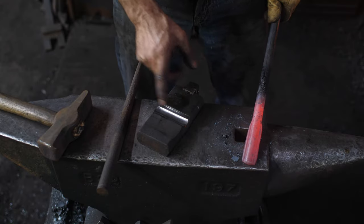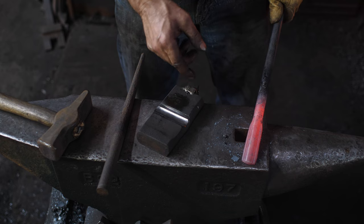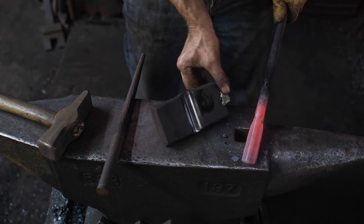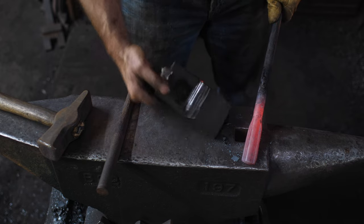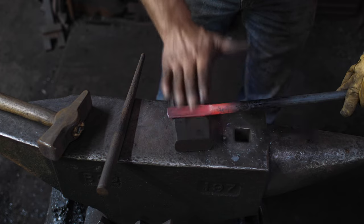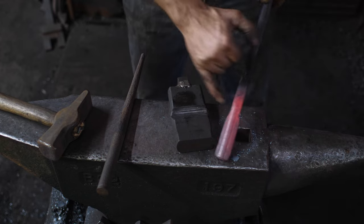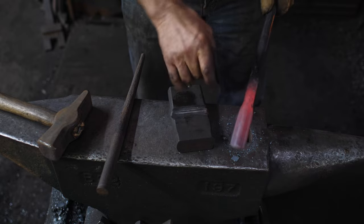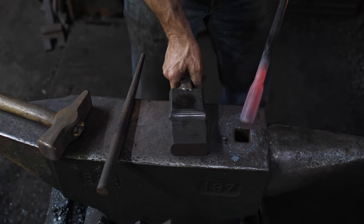So what I just used was my collar die. This is a die to make a decorative collar profile, and you can see what the die looks like. Hopefully you're catching that. And then when I put in the round bar and smash it forth, I'm able to get this cool cross section. This I'm going to now bring around to make the knuckle. Let me show you.